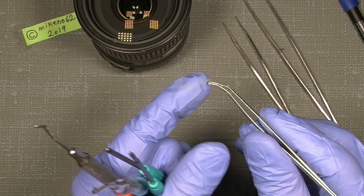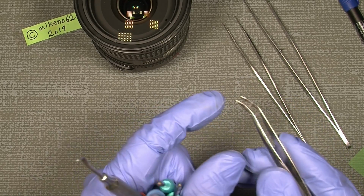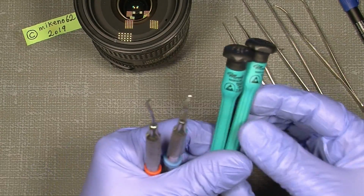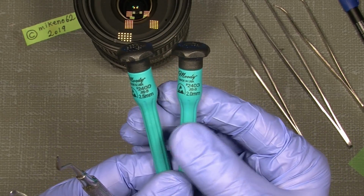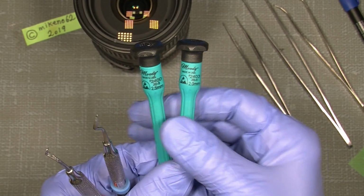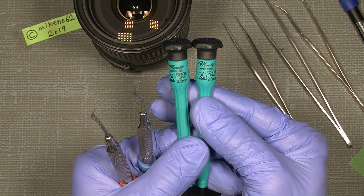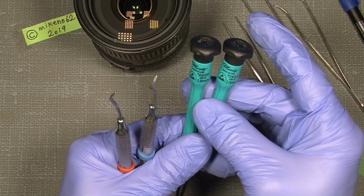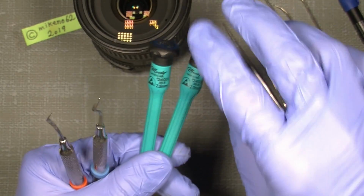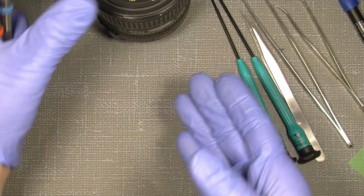And this is a curved tweezer, which I have sprayed with plastic dip, which will make the end very sticky. Well, this is a bit used, so maybe it doesn't work so well. And we need some JIS screwdrivers. Those are from Moody Tools, which I buy on ifixit.com. And just to get things clear, I am not sponsored by any company. All the things I show in my videos are bought with my own money, so no one sponsored me. We need a 2mm and a 2.5mm, and it's important that it is JIS, because this is a Japanese made lens, or designed in Japan.